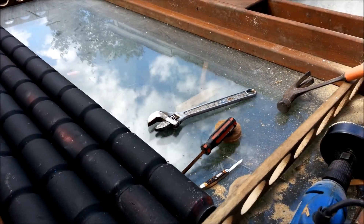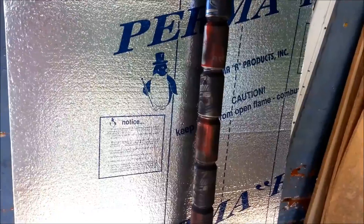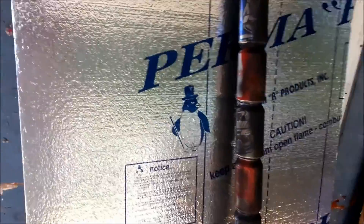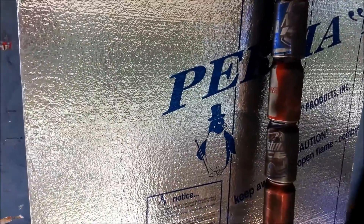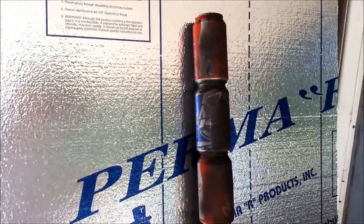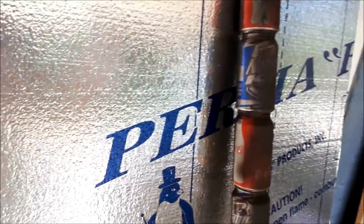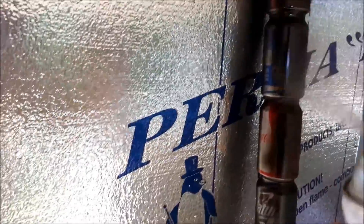With all this black and glass, it'll get up to around 180 to 200 degrees inside here, and that heat will be pumped into the house. One of the steps I haven't gone over yet is painting. Pretty sure everybody knows how to spray paint, but it's part of the project. We already started on this can — we're using flat black, the cheapest paint we could find, because I didn't have enough on hand and had to go buy some.